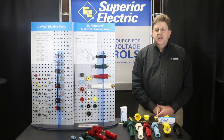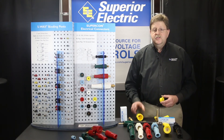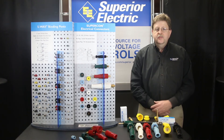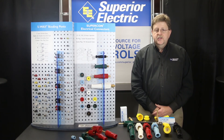Receptacles have color matched nylon caps and bodies. All plastic parts of a receptacle are molded in the same color to allow for accurate circuit identification on both the front and back of the panel when installing. Receptacles come with three washers and two nuts. Wiring connection is made by a threaded stud, by a wire wraparound, or by lug or direct bus bar connections.